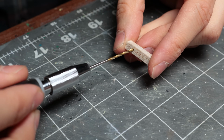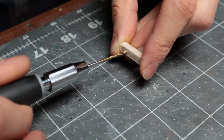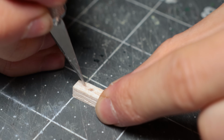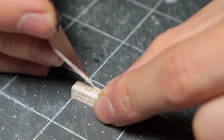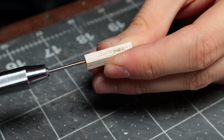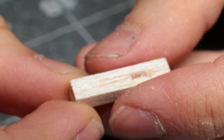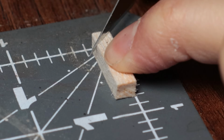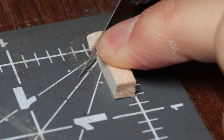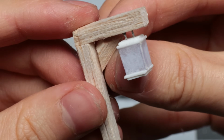I gently drilled the larger piece of the arm on one side, 1/4 of an inch from the end to halfway through, and widened it on each side to fit the prongs of a 5mm LED in comfortably. With that open, I drilled straight down the length of the arm end to meet it, before cutting in a space on the arm end to fit some wire through at the bottom. The bracing I just cut at a 45-degree angle on the ends, trimming it to make sure it would line up before gluing it in place, but that's later.